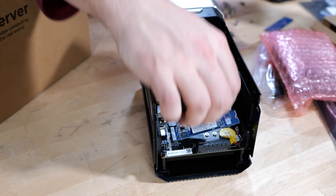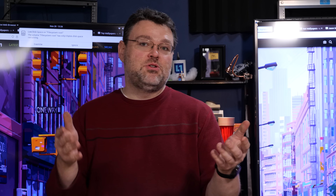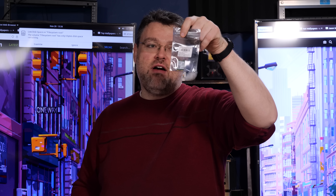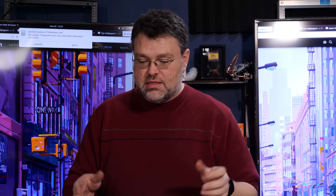As well as an integrated Arduino co-processor AT-SAMD21 ARM Cortex M0+. It's got HDMI 2.0 and DisplayPort 1.4. In addition to that, it's also got three M.2 — B key, E key, and M key. So that means you can add your M.2 Wi-Fi adapter, which I just so happen to have here — Intel Wi-Fi 802.11ax adapter, plus all the other stuff.